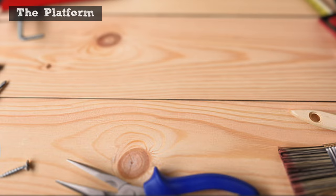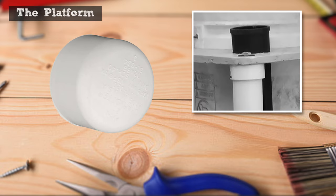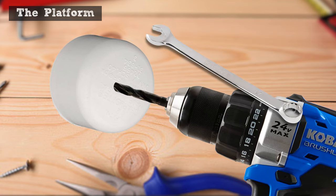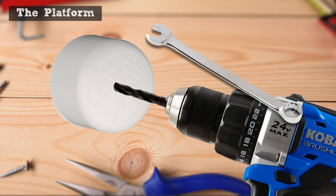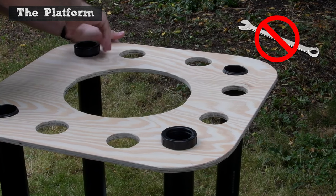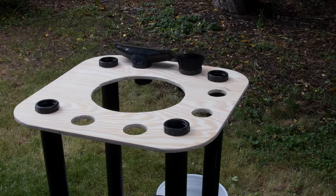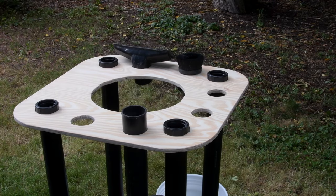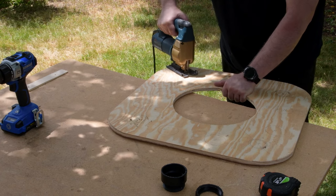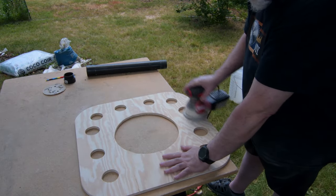The platform attachment. All the carts I saw used pipe caps with holes drilled so that they could be bolted onto the plywood and then glued to the legs. This makes the top a pain to remove and requires tools. Threaded pipe couplers make it super fast and easy to remove the top when needed, and they're solid since there's more surface contact. My platform is made from half-inch plywood, making it lighter while remaining strong. I used a jigsaw to cut my openings, sanded, and then painted it so it looks spiffy.